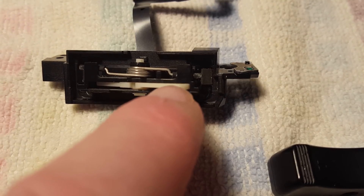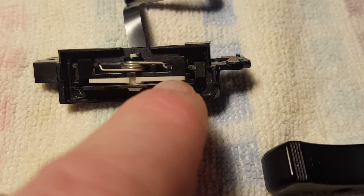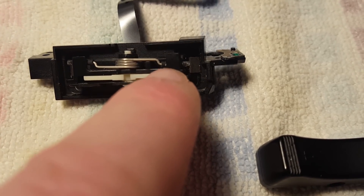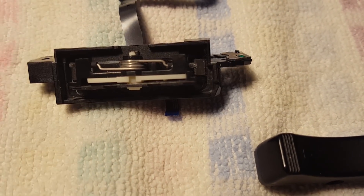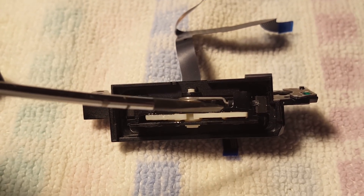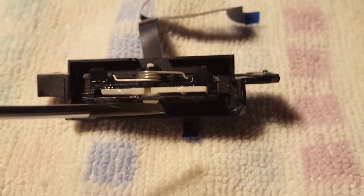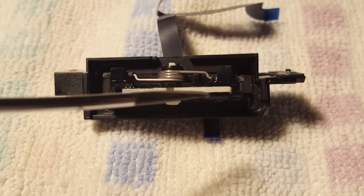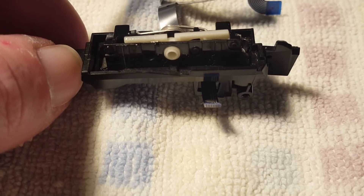So I guess all I can really do is try to force some grease into this, being careful to avoid the potentiometer, because once you get grease into that it's going to be messed up. As you move this thing around you can feel that as it slides, if you move it a bit faster it would make this squeaky noise. Continuing this operation, I now have grease up in there and on the other side. I did not put any grease down where the contacts are. If you now move the white piece it does seem to move a lot more smoothly, so I think it's gonna be okay.